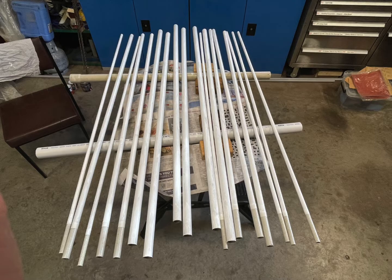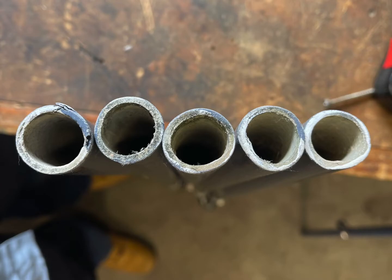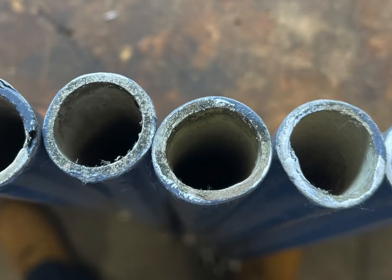The next part: you can see the ends of the poles here are deformed — they're not exactly round — and this is after they had been installed for a couple of years. The clamps on the center hub, as you can see in this photo, have compressed the poles. That compression occurs because when the poles are clamped down on the hub and you do up those U-bolts a little bit too hard, the fiberglass poles will deform and can actually crack.